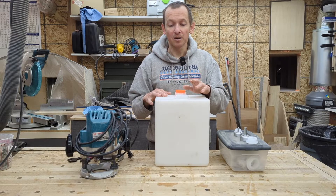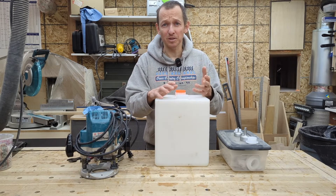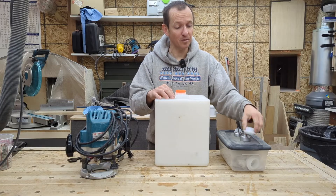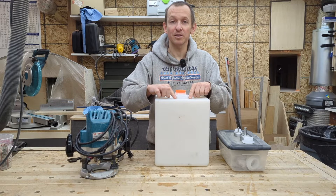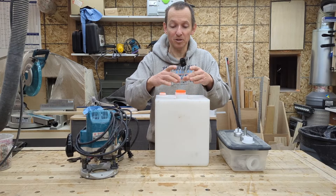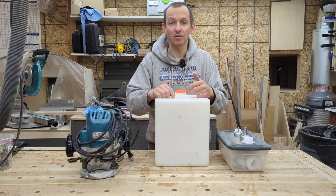So today I'll just quickly cover what you need to make this happen and how to install them. The concept is really simple. You essentially drill a hole, and then you have one of these fittings that before installation looks something like this. You just spin it so fast in the hole that the friction along the seam causes the plastic to melt, and then once that fitting and spinning motion is stopped, the plastic re-solidifies and you've essentially welded a fitting into that hole.